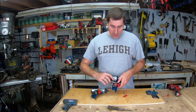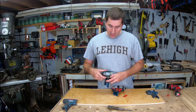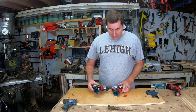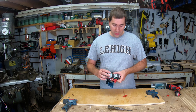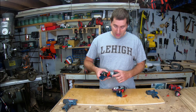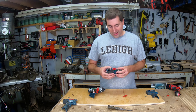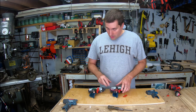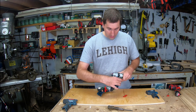Something else that jumps out is the control board. The older tool has a nice little piece of aluminum acting as a heat sink. On the newer one there's no heat sink on the control board — just a little extra solder that tries to help dissipate heat, using the PCB itself as the heat sink. The gearbox is also a much larger diameter on the older tool, based on the motor size choice. The LEDs on the older tool are connected with a flimsy little ribbon wire; the newer one uses a much nicer wire with a better connector that will be more durable. Both switches seem very nice on both tools.